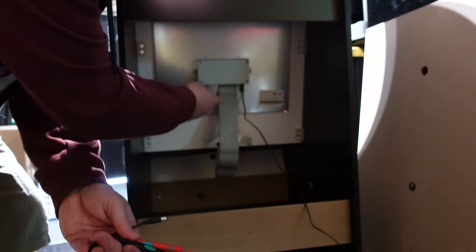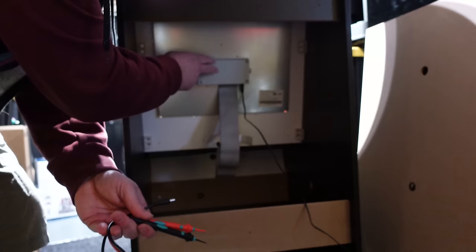I've already tested the power supply and it is 12 volts. I'm going to take everything upstairs because it's impossible to film down here. I'm going to take out this box because that's where the power adapter goes in — it's also where the screen connector is. Take it upstairs and we'll double check we're getting voltage and figure out what's going on.